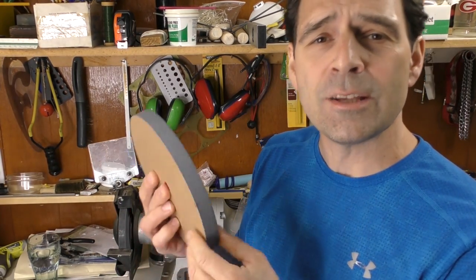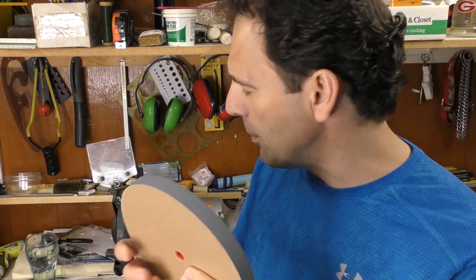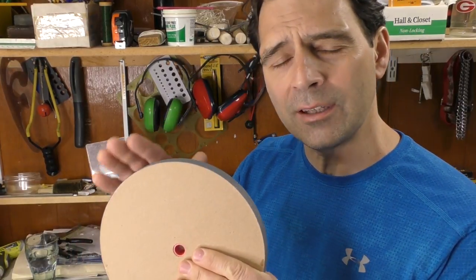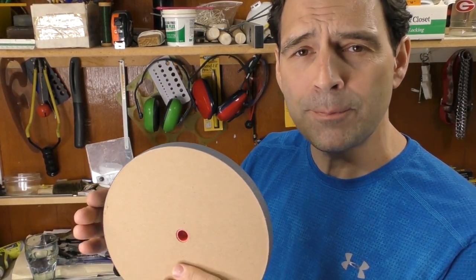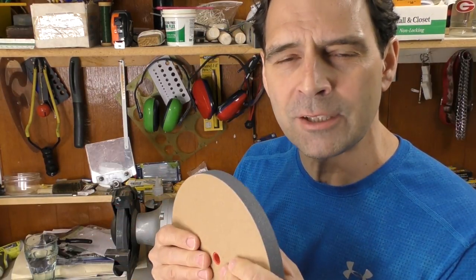The reason why you want it dedicated to this is when you mount these wheels on the bench grinder, if they're not perfectly centered there might be a little wobble. You can take that wobble out by touching the edge with a little bit of rough sandpaper as it's spinning, but you don't want to have to do that every time. Last time I checked you can get a 6 inch bench grinder for as little as about 35 bucks. Technically the instructions say you need a grinder that spins at least 3,000 RPMs. I do have an Amazon affiliate account and will put a link in the description to an affordable, well-reviewed bench grinder.